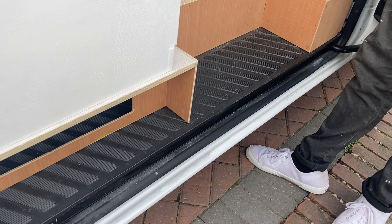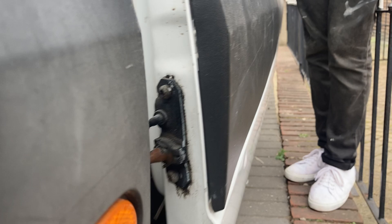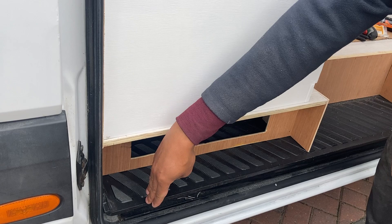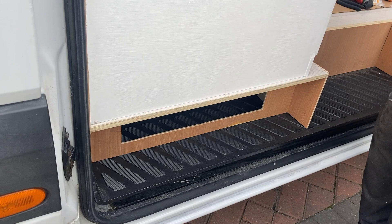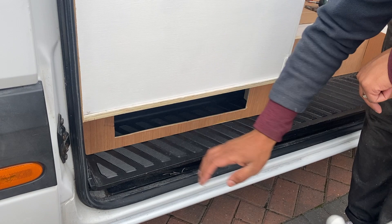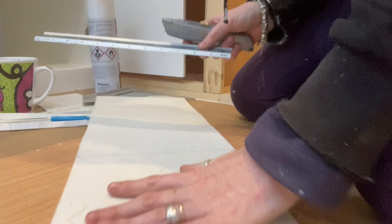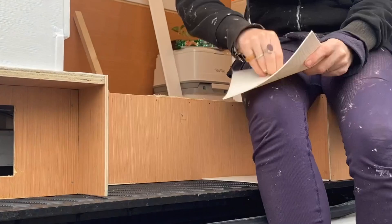Tell us about why you had to put that bit back. Well, I forgot there's a door stop that comes in here — it stops the door going the other direction. Originally I had the front of it exactly there, but it meant the door could only close partway, which was slightly problematic. So I had to push it back about seven or eight centimetres, which enables the door to actually shut, and we've still got enough space for a pair of shoes each. We decided to use some leftover lino to make the step blend in with the rest of the kitchen, so we cut it down to size and stuck it on with flooring spray adhesive.